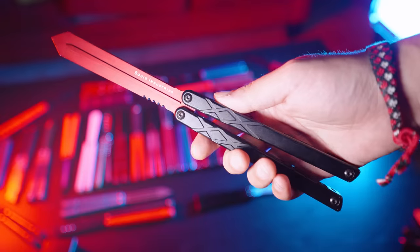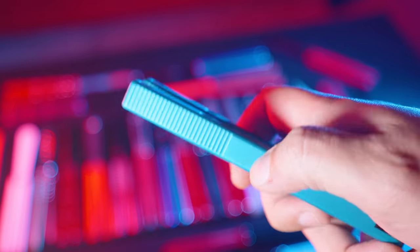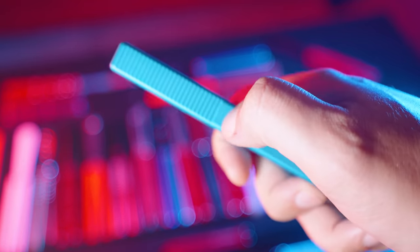The Swordfish appears to be a more affordable Tsunami, whereas the Squid Trainer is the Squid Trainer. They both have aluminum handles and a bushing pivot system — and that's pretty much where the similarities end. The materials used: 6061 aluminum vs 7075. Steel blade vs aluminum blade. The weight: 4.6 ounces vs 3.8 ounces — nearly a 20% difference. The balance: neutral vs modular handle bias. The texture: machine texture vs just a bead blast texture. The jimping: long and rough jimping on both sides vs small cutouts on one side. They're completely different products in our eyes.